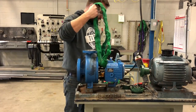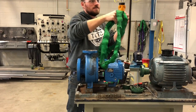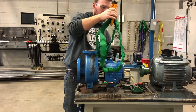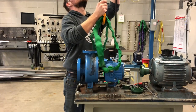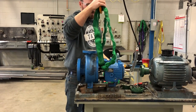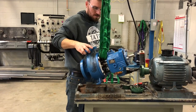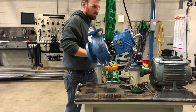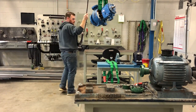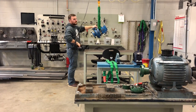So now we're going to go ahead and rig this thing up. I decided to put the sling through the top cross members here, but there's probably a couple different ways you can do it — you can choke it, you can basket it. When you're lifting it, mainly make sure you're slowly bumping the controller so that it goes up slowly. That way if it's going to tip over or slide to one side it's not a fast motion. So make sure when you're picking something up you just go slow.